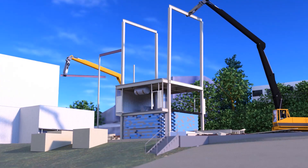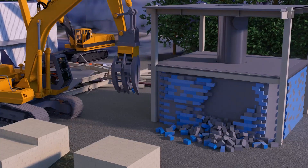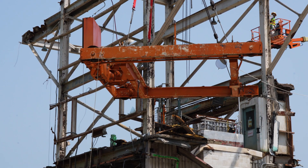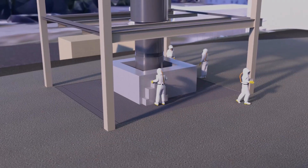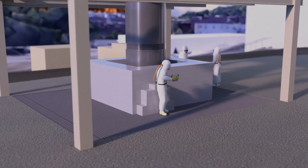The third phase would be to fail the shield block and grab the precast concrete. Once we've removed the overhead hazard associated with the precast concrete slabs, we'll have structural engineering and safety evaluate the remaining structure to allow us to re-enter the facility to do some reactor prep in anticipation of the reactor removal.